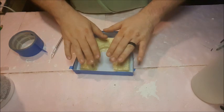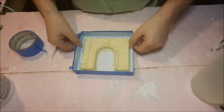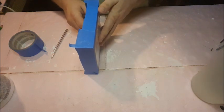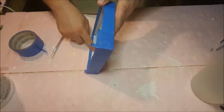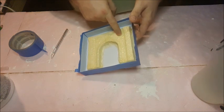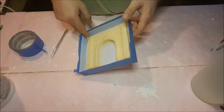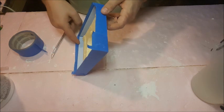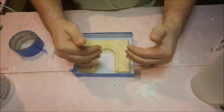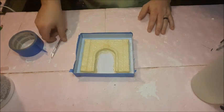And to give it a little more strength, you want to have a firm base. So I built this up, I think it was an inch. It's a full inch up. I measured to the tallest part of the original mold, which came to 3/4 of an inch. So I just cut these sides to an inch tall, and that'll give me a nice solid base